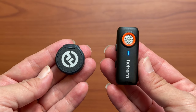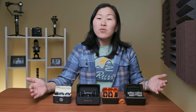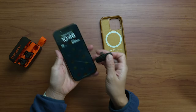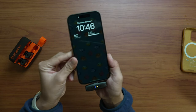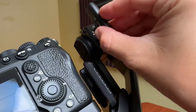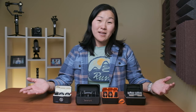The Hollyland's transmitter is the lightest and smallest I've ever seen on any microphone system, coming in at 9 grams compared to 14.9 grams for the Hohem. Because the Hohem and the Hollyland are the smallest, both had to make some sacrifices to keep that compact form factor. The Hohem receiver is so small because it doesn't have an actual power source, so it technically doesn't even need to be charged. However, that means you need to add your own power source to use it with a big camera like a mirrorless — plugging into a battery power bank or gimbal. So in terms of connection and usage, the Hohem may not be the most flexible or convenient depending on what kind of camera you're filming on.